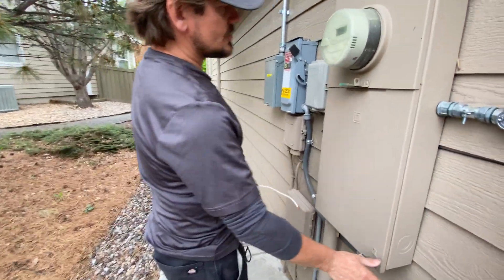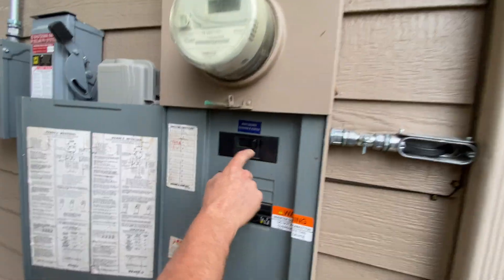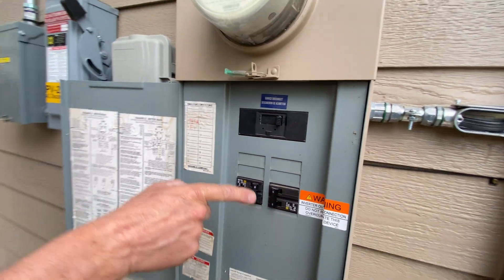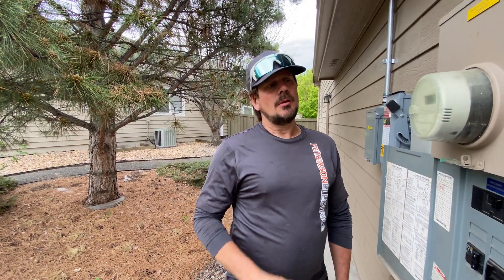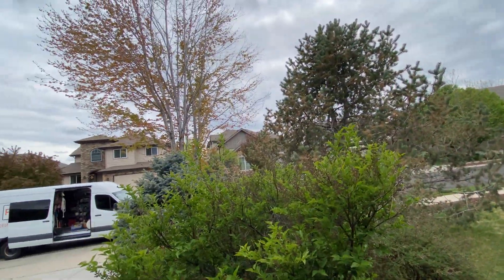So this is his main breaker. If you have an all-in-one combo box outside — this is a main 150-amp, and his 60. So this thing tripped the 60 and the 150. He also had solar, so that back-feeds into the system, and none of that got hurt either that we can tell. Keep in mind when you're deciding to put in an electric car and you want to keep it as cheap as possible, make sure you clean out one side of your garage, put the car on the side closer to the panel.